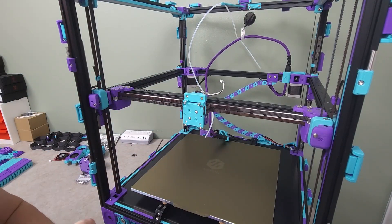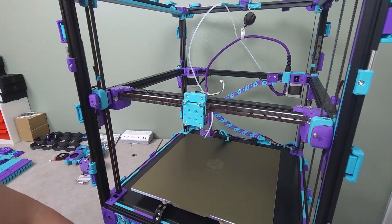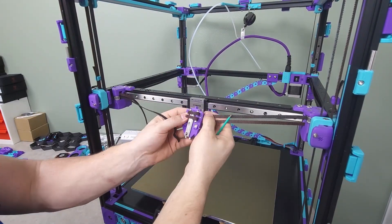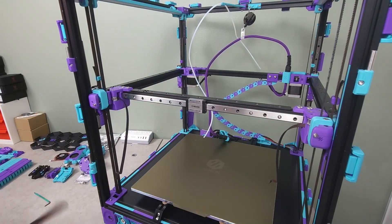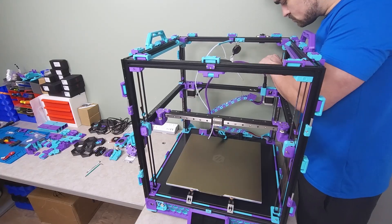A lot of the hardware on this printed tap will also be transferred over to the new CNC one. These belts have just over a thousand hours on them but there's no sign of wear, damage, or stretching, so I'm going to be reusing them. Next up I disconnected everything from the Z chain that was connected to the AB motor mount.